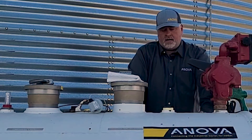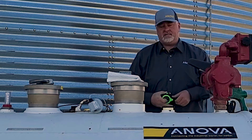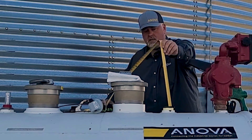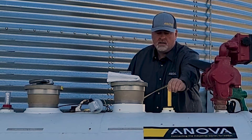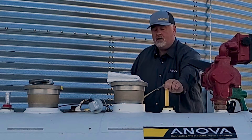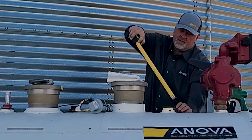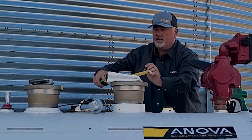After installing the two-inch adapter, we need to get a measurement of the height of the tank on the inside of the fuel holding vessel. I'll use my tape measure with spill protection handy and drop it down into the tank until I feel the bottom. It's 63 inches to the top of the threads of the tank. This is a double wall tank, and as I pull the tape out I can note we have 19 inches of product inside.